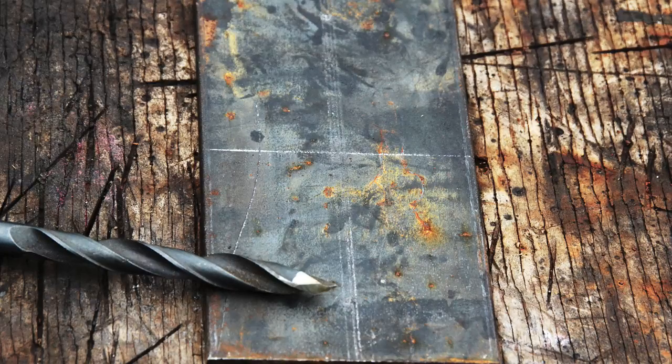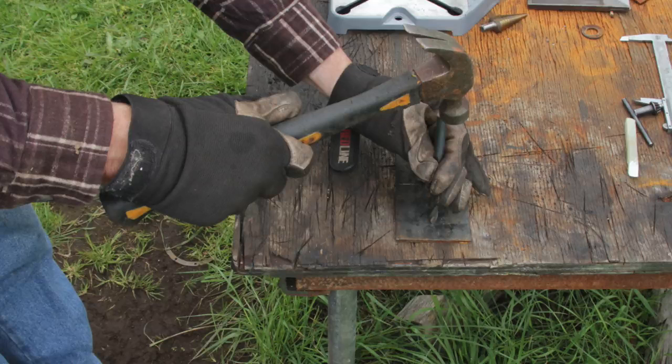I'm showing that I used an old drill bit with the end dulled and ground down to make a punch. Right in front of where that tip is, I'm going to make a center punch that's a little deeper and bigger to center-punch the holes for the bolt hole pass-throughs. That way it makes sure the drill bit doesn't walk around. If you've never used a center punch, it's not that hard — you just line it up and hit it with a hammer right in the center of where you marked it. It puts a little dimple in the metal, deep enough so the bit won't walk around and your holes end up exactly where you wanted them.